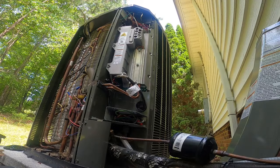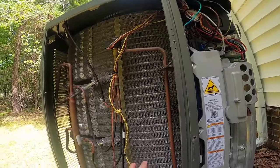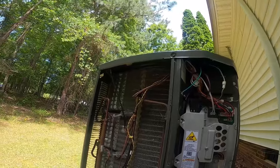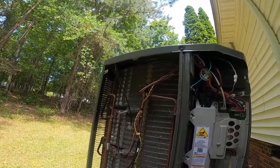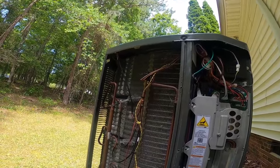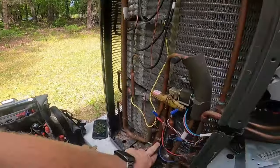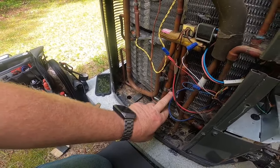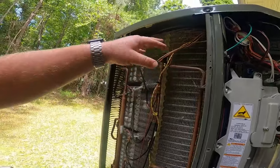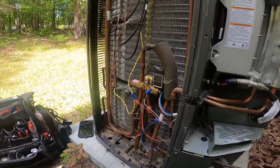These units have an EEV and a stepper motor in the outdoor unit. There's also one inside. There's a suction pressure transducer and a suction line temperature sensor outdoors, and you've got your gas and evaporator temperature sensors on the indoor. In cooling mode, the outdoor EEV cranks wide open and the indoor controls superheat. In heat mode, the indoor opens wide and the outdoor stepper motor regulates refrigerant flow, measuring superheat between the suction line sensor and the suction pressure transducer reading. The fault was for this sensor, so let's check it out.